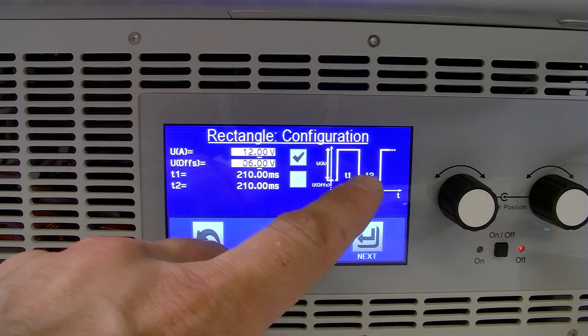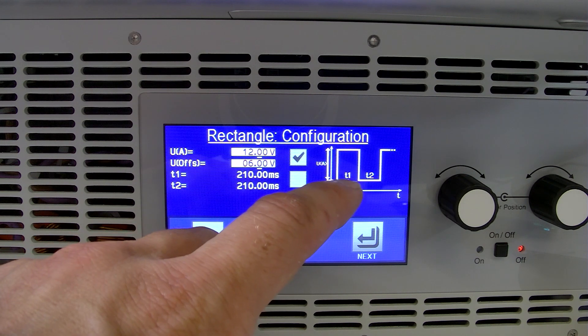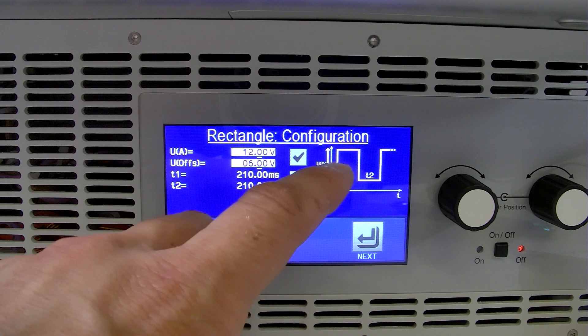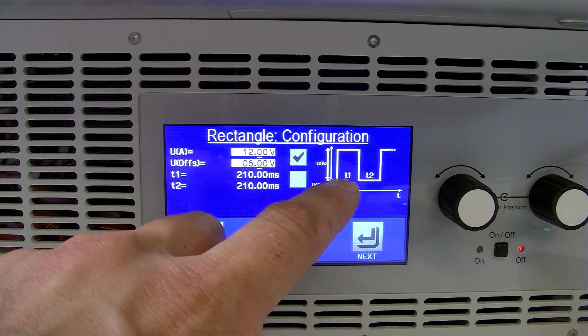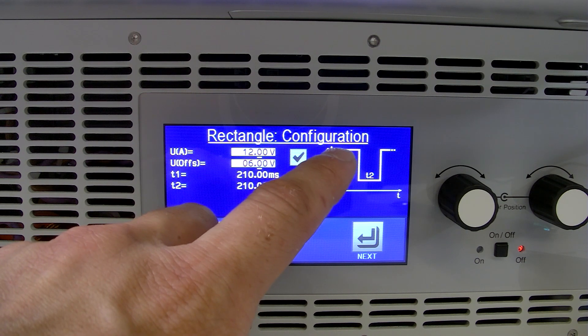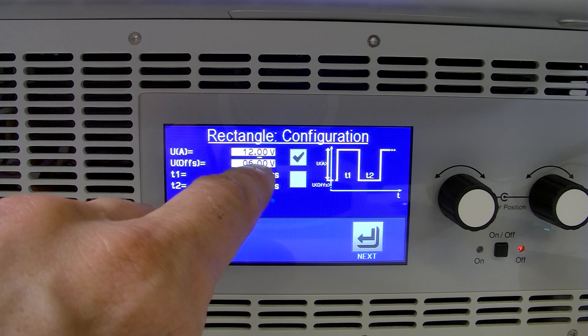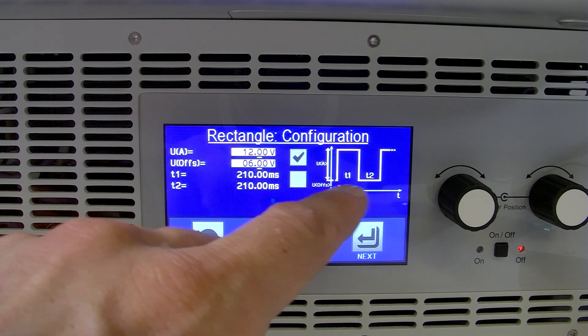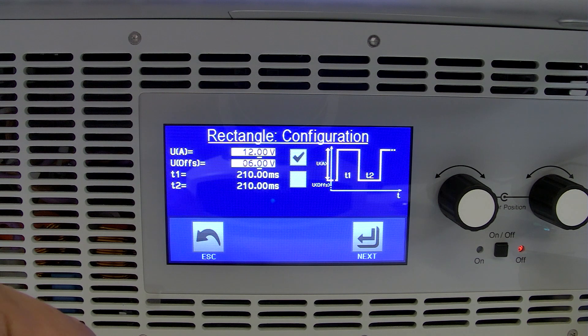Here's a little diagram that shows the values you're setting and what they represent in terms of the output. I want a waveform that's going to go plus and minus 6 volts around a 12 volt axis. So I started with a U offset of 6 volts, because that's going to be the lower edge of our rectangle output. The top edge I want at 18 volts, so I add 12 volts to 6 to get 18 — that's why I have UA at 12 volts and U offset at 6 volts. Timing is going to be a couple hundred milliseconds per cycle. I've increased that time a little bit; it can go much faster, but because we have three different control loops all kind of fighting each other, it's a little cleaner — as when you'd be charging and discharging a battery or testing a drivetrain on an electric vehicle, for example.